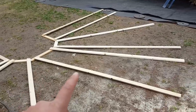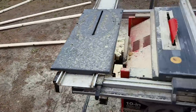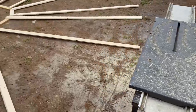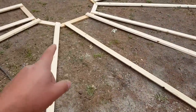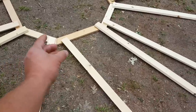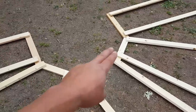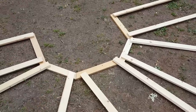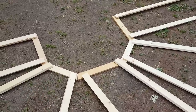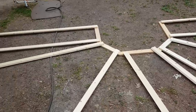I got all my 1x3 uprights cut. What I did is I ran them through the table saw at 22 and a half degrees, so that when I staple them all to my top and bottom pieces the angle will match. Then I'll be able to put my little toggles in there and lock them all together. I'm going to try to make this all one piece — I think we'll be able to manage that instead of a bunch of different sections, and it'll end up being a more rigid and stronger section.